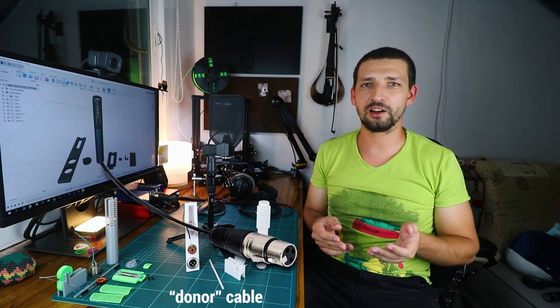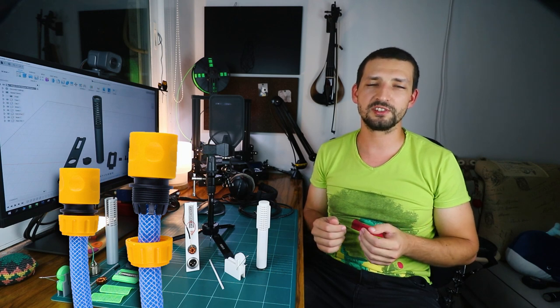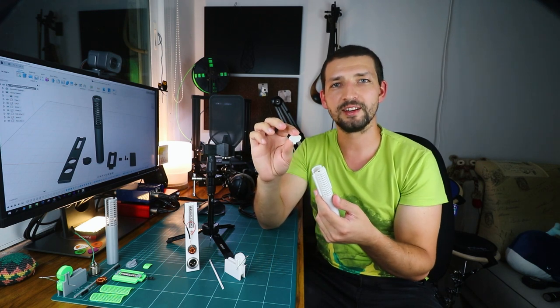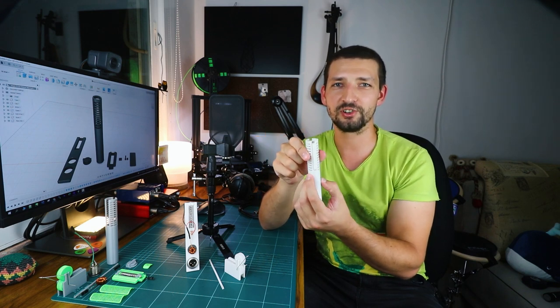The simplest alternative is to use a permanent XLR cable, maybe make two small holes with a small zip tie, or design some attachment like most cable connectors use, similar to garden hose and microphone stands. The cap is held by the microphone grills. It's sort of a snapfit connection without snapfits, thanks to the flexibility or elasticity of the structure and the plastic.